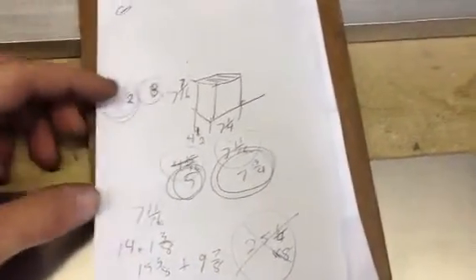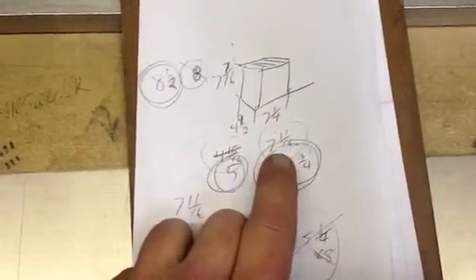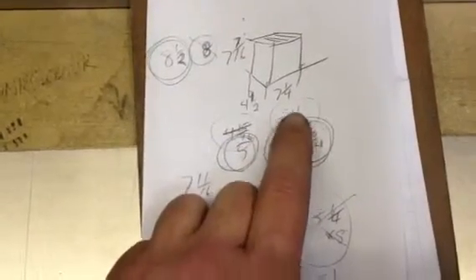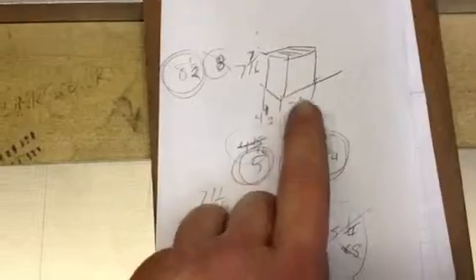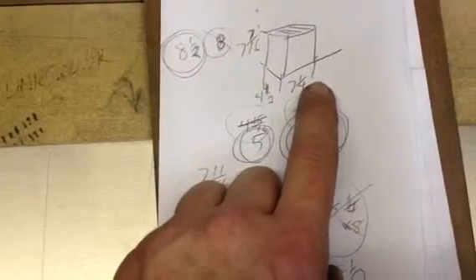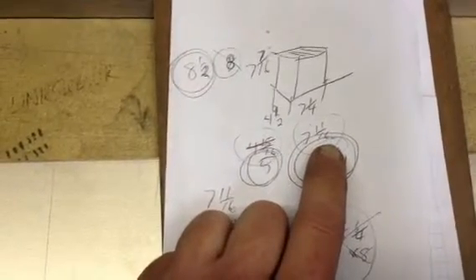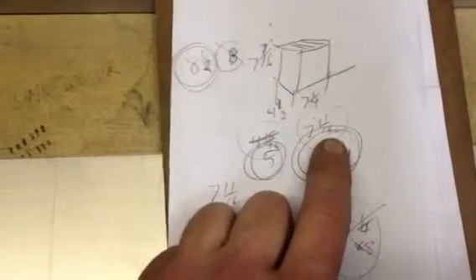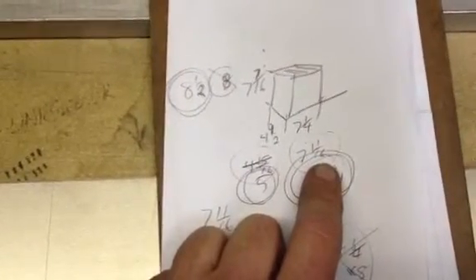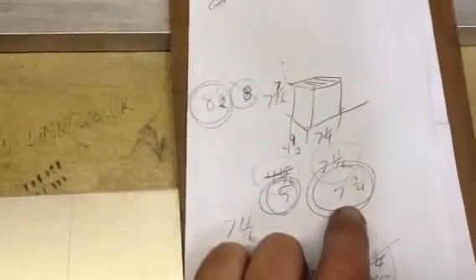After you've taken all of your material, physically stuck it together and measured for the proper dimension — as you can see here — I goofed up my dimension a little bit. I did my math to get 7 and 11/16ths: that was 7 and a quarter for the batteries themselves, then 7 and 11/16ths was the batteries plus the end insulation pads. However, that's the wrong way to do it. What you want to do is actually set all of your final pieces together and measure them as a whole. Don't add A plus B plus C, because what you come up with ends up being a 16th short, which means you have to make the entire box over again.